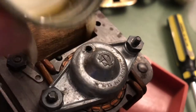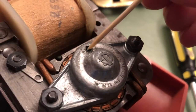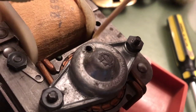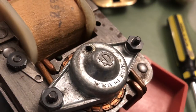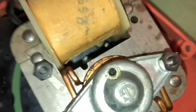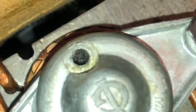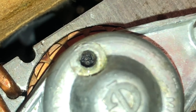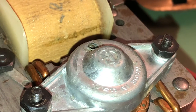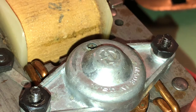I'm going to be using Mobil 0W-40 — it works well for clock mainsprings and things like that. It's a slightly thicker oil, not super thick though. I'm dipping a toothpick in the oil and then putting it into the hole. I don't know how much this thing will take. The oil is definitely in there but I'm not sure how much is soaking in. Worst case scenario if I over-oil it, I just clean the thing out and do this again. I put one more drop in on my toothpick.